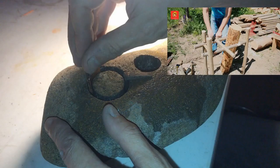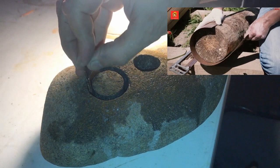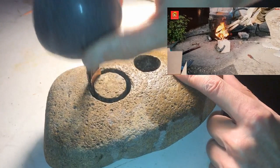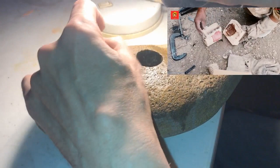This is a sort of two-for-one explanation, because we see how with a shallow, very short tube you can create a very deep hole, but also, with copper and wooden wedges, I'm going to remove this granite core. So it's often said, you know, you can't do it without steel. Well, that's just bunk. You can do it very easily. And so whether you're drilling with that copper sheet at shallow, or you cast just a short hardened copper tube,